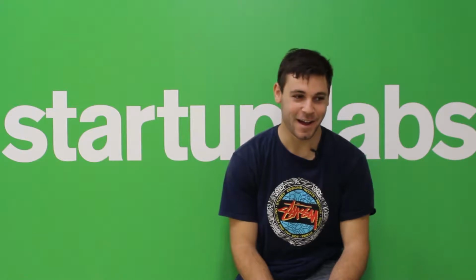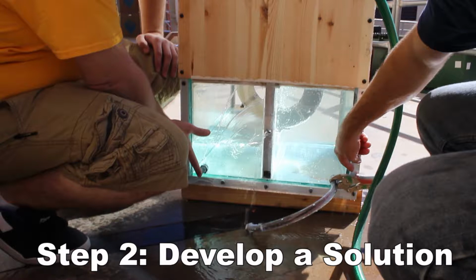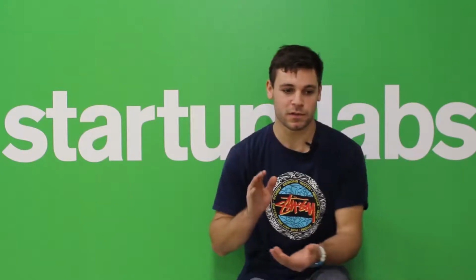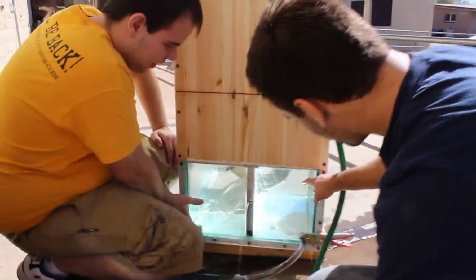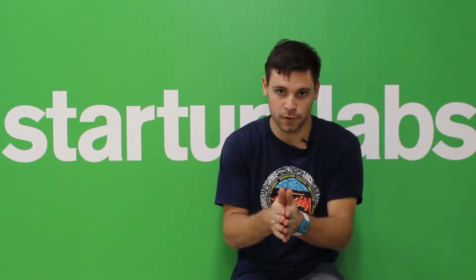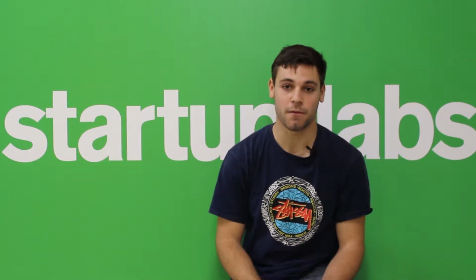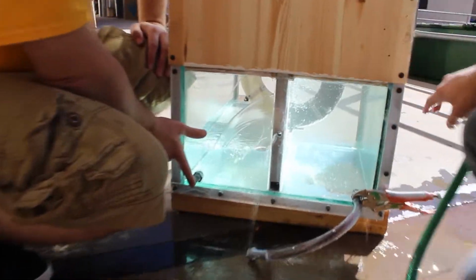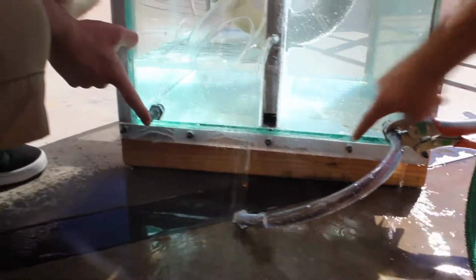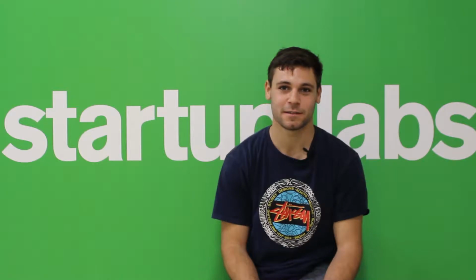Well, it didn't explode, but we did find that there were some leaks, which is kind of interesting the way that it came out. The way that it was assembled, there were certain zones where the geometry wasn't right to get the sealant in on the inside of the seal, so we were forced to make a pressure seal. Anyway, what we discovered through the testing is those areas are now problem areas. So what we're going to end up having to do is cut access panels into the back plate. And with the acrylic and a couple bolts, we should be able to seal that in and reseal all those joints, hopefully eliminating all the leaking. But that's what testing's for, right?